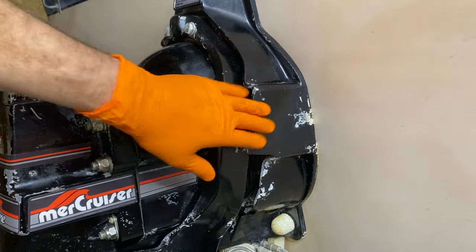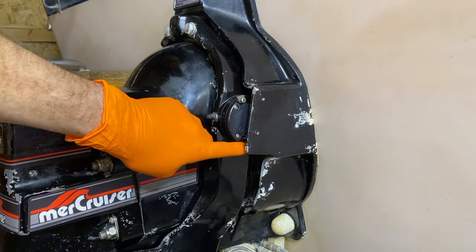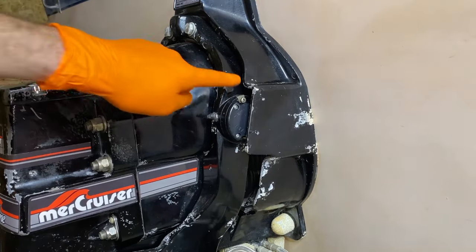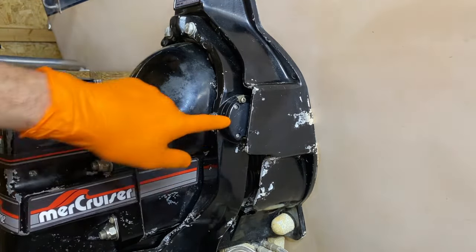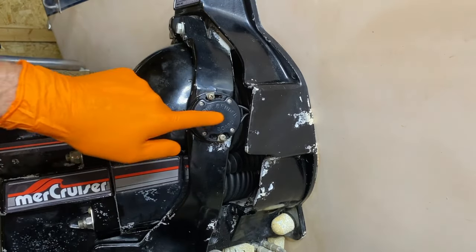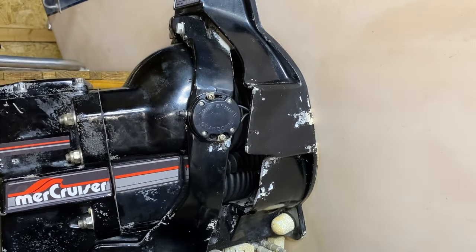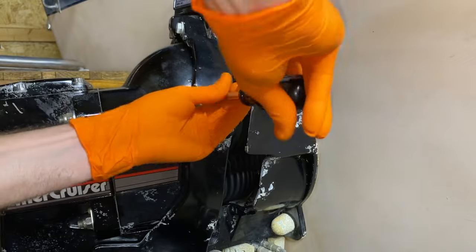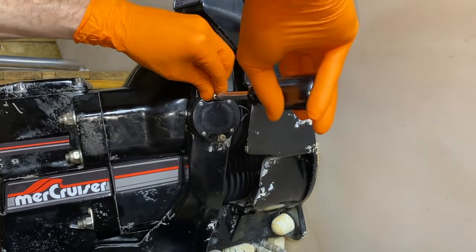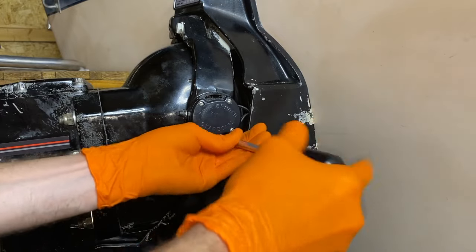Looking at the transom, gimbal ring, bell housing, and out drive — on the starboard side is your trim sender switch with two Phillips screws, one on top and one on bottom. To get better access, get inside the captain's seat and turn the wheel counterclockwise or to the left, which rotates the entire gimbal ring outward and the out drive to the left, exposing the entire switch. You'll notice four additional smaller, shinier Phillips screws — do not touch those. If you have already aligned the two notches on the inner portion of the switches, you don't have to do this step at this point.